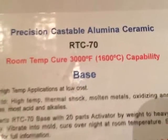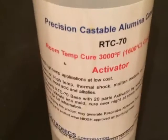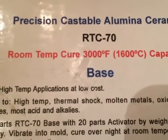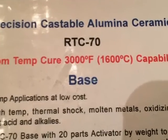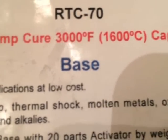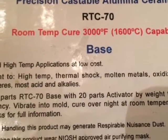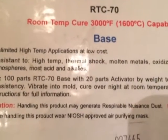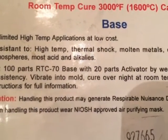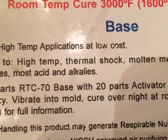Today I'm going to be working with a ceramic material — a castable, powdered ceramic with a liquid binder that you mix with the powder. This is for making small parts that need to withstand high temperature. It says it's able to withstand 3,000 degrees Fahrenheit from just a room temperature cure, meaning after it hardens and you take it out of your mold, it should be able to withstand that kind of temperature. I'm going to be heat curing this in a high temperature just to make it stronger.